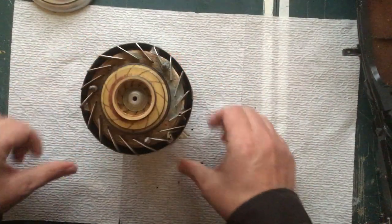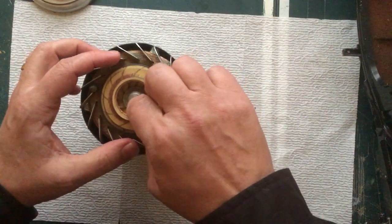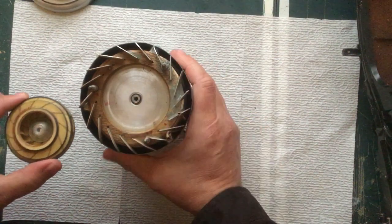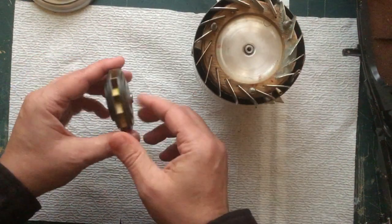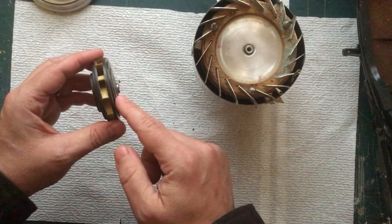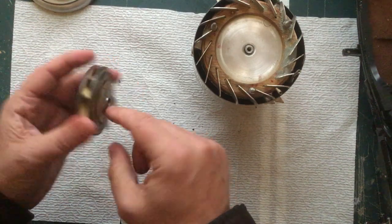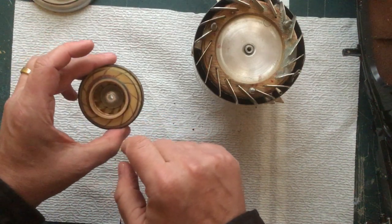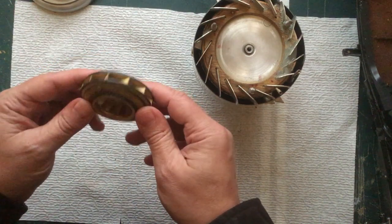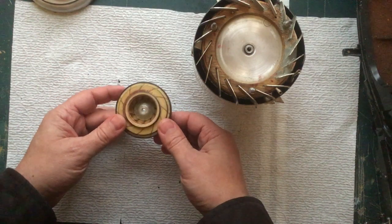Inside here, again, we said the compressor is plywood. Again, it's not screwed in, but that would screw into the shaft. Here you can see the end of the shaft, and the first bearing is right in there. The compressor is made up of 2 end plates of plywood. The black is carbon fiber wrapped around. It has a steel insert here where the shaft goes in, an aluminum center cone here, and all the blades are thin plywood. Again, it works, but it's not going to be as efficient as a commercially bought engine.